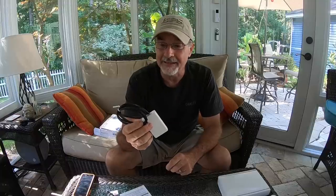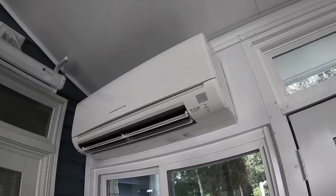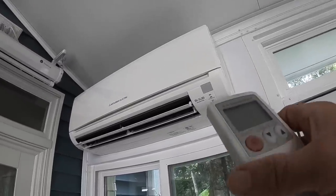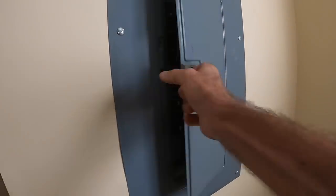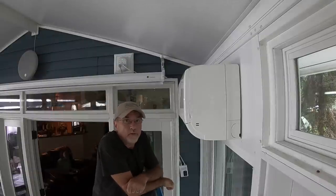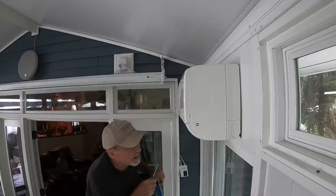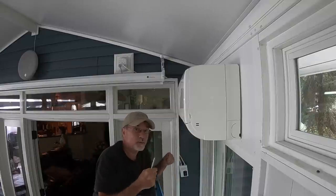So we're going to go ahead and hook this up, connect it to our internet, and see if we can control this via our smart device. As with any maintenance on your air conditioning unit, make sure you have the power turned off — not only at the unit but also at the circuit breaker. We'll turn the power off with the remote control first, then turn it off at the circuit breaker. Once power is removed, we'll remove the cover to gain access to the control board using the two clips and two Phillips screws.